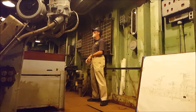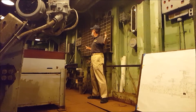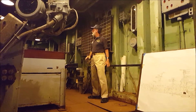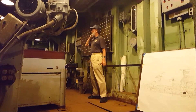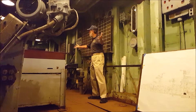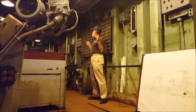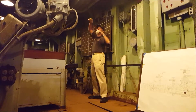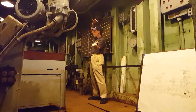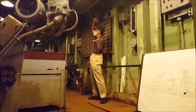Time moved on to our advantage. The battleship Texas was lucky — she was rebuilt after the Washington Naval Treaty, so 1925 to 1927 we took everything down to the keel. This space became available: part of boiler room number one became the new plot. It's lower, better protected, a little warm because we still have a boiler back here and a dynamo up top and heated fuel oil underneath — hence the air conditioners added in 1944–45. We have a raised computer room floor. At the same time we put in the GE fire control system — an AC alternating current system using synchro motors. You turn the director aloft and down here a slave rotor turns in the computers. If power fades and comes back, it resyncs itself — a big advantage.